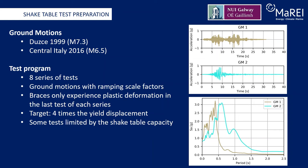The primary objective of the experimental program is to validate the performance of the self-centering system under these constraining ground conditions. It should be noted that the high frequency and low frequency components of the two selected ground motions were filtered according to the shake table technical specifications. The tests were divided into 7 series according to the brace pair installed, with the final test run conducted without any brace members present, so that some characteristics of the self-centering frame could be obtained. Following the first test of each series, more tests were performed with amplitude scale factors carefully adjusted until the brace reached its yield limit state. The ground motion amplitude scale factors were calculated based on the peak strain values measured in the previous tests and the brace yield strain. After the yield displacement and the corresponding scale factors were identified, the last test aiming to impose permanent deformation to the braces was conducted. The scale factor used in this test was determined according to the target displacement, normally 4 times the yield displacement, but it also could be limited by the overturning moment capacity of the shake table.